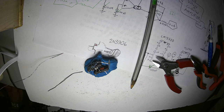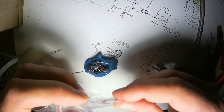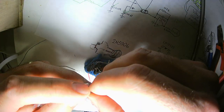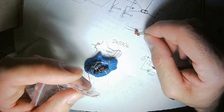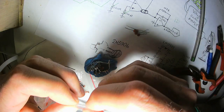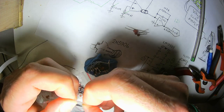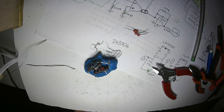As long as it's, you know what, I have a bunch of 220 picofarad caps. I'll use a couple of these. In fact, I need four because there's capacitors up here as well. But let's concentrate on these right now. 220 picofarad capacitors. These are such tiny value caps, and they're not really doing anything signal related, so it's not important that they be high quality. Ceramic discs are totally fine.